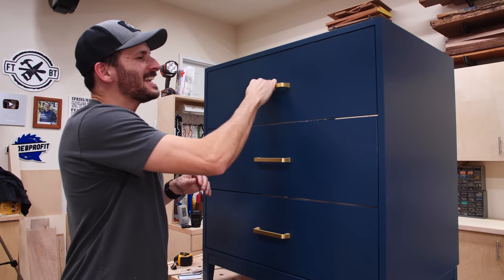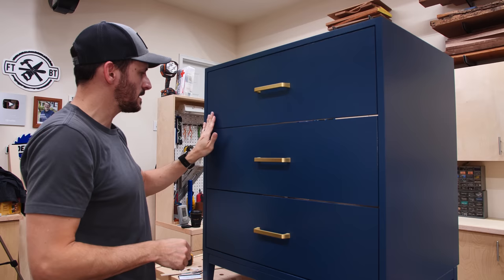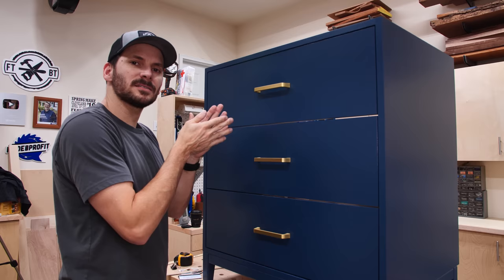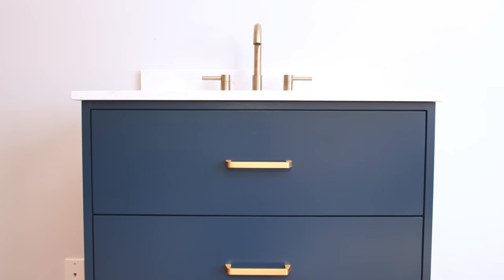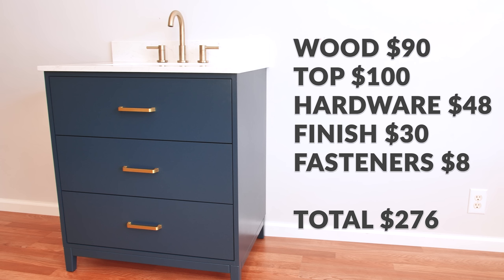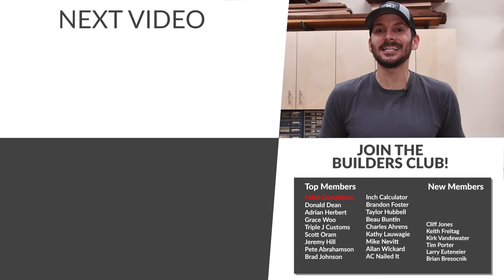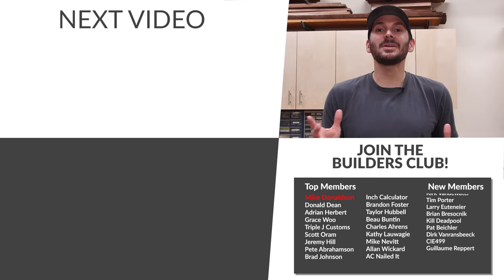It's pretty solid. I did shim it a little bit back underneath the drawer to get the front flush. If you do need to flush up the front, you can always put in some L brackets and shim it however you need to. Now let's put the top on and see how it looks. For a quick breakdown of the cost — though these may vary for your area — the wood would be about $90, the top is $100, the hardware including drawer pulls and slides is $48, the finish is $30, and $8 for fasteners, for a total of $276. If you want to see the full remodel, you can check it out and see how the bathroom looks with the vanity in it. If you want to build your own vanity, I'll have a link in the description for the plans. Big thank you to all the folks that have been joining the Builders Club, and I'll catch you guys on the next video — we're going to build something awesome.